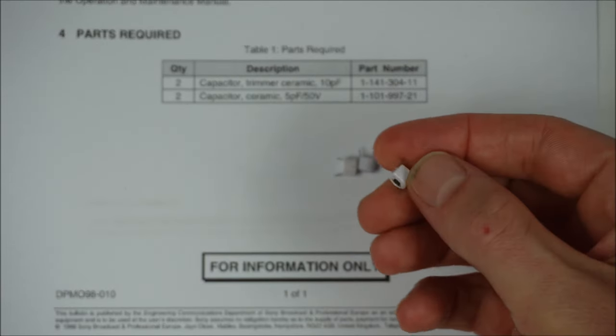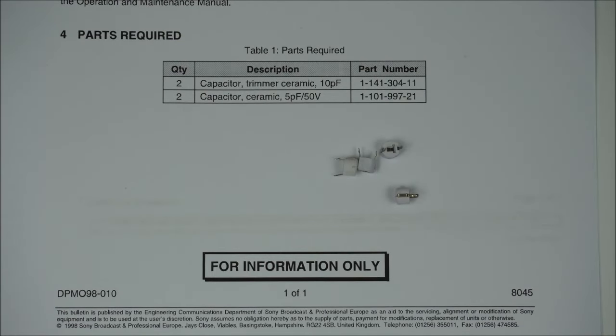The difference between, say, a volume knob on the front of the monitor, the volume knobs are designed for thousands of turns, whereas trimmer adjustable electronic components are typically only designed for maybe a couple hundred turns. They're like a one-night stand. You screw it once and that's it, never again. With a trimmer capacitor, it gets set in the factory, one and done. That's it, one-night stand, never adjust again.